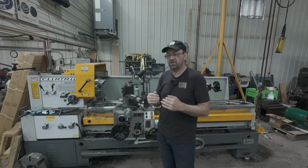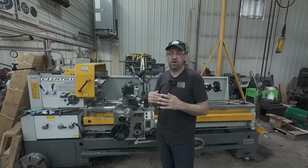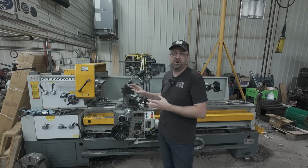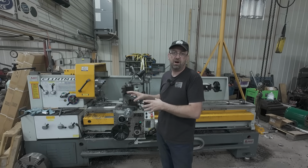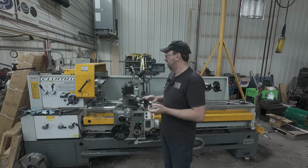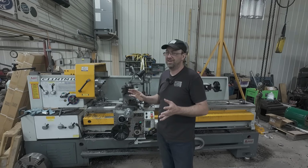So there are times when you want to offset your weight and balance your offset weights, but this was not one of them. And as you saw, I was running it pretty slow. I started out slow when I first did these on this lathe just to make sure, because I used to run these on the big Monarch, which was significantly heavier. So we're just fine where I was, and running slow is the key.